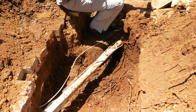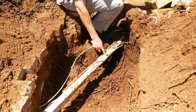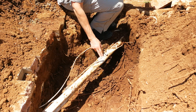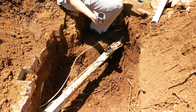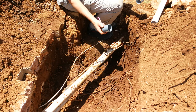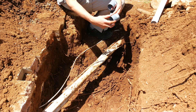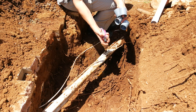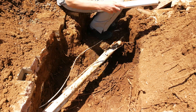We've been digging a trench here because we are putting a pillar here, and we dug through this pool path. In this video we're going to quickly demonstrate how to mend this pool path. What you'll need are some connectors — these are for high pressure, so these are not the plumbing ones, these are for pool. They're much thicker and they are for high pressure installations, and then obviously the glue and the pipe as well.